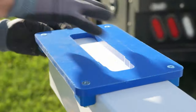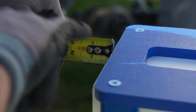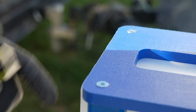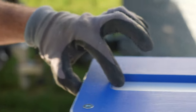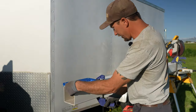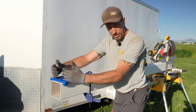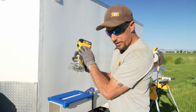The template slips right on the post and holds tight this way, but it can still move up and down, so we want to clamp it in position. We're going to set it a quarter inch below the top of the post, and that should give us two inches from the top of the post to the top of the top hole. I'm going to clamp on the bottom side so this cannot shift up or down on the post. We're going to go ahead and turn this bad boy on and see how it works.